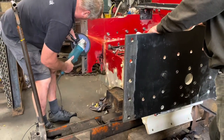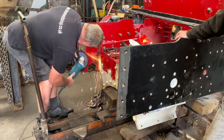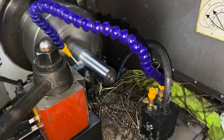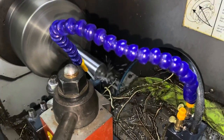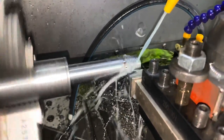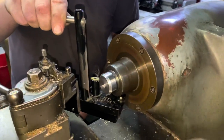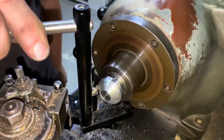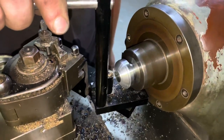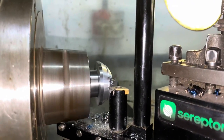Fastening the whole assembly onto the main frames, we didn't want to rivet these on — we want it to look like rivets but we want it to be removable. Practically, riveting through the actual frames would have been really quite difficult; we couldn't have got it up on its end in the press and it would have been quite difficult to support the dolly. So we're using the CNC lathe at Steam Workshop to machine specially rivet-headed bolts. It's exactly the same from the outside with the rivet head, but behind the scenes it's a bolt where we can put a washer and nut on the end, so if we ever need to take the buffer beam off we can. The actual rivet head itself is created manually using the spherical cutter tool in the lathe, which pivots around a point lined up with the centre of the rivet-headed bolt, allowing you to machine off the right amount to match the same diameter and curvature as the rivets in the buffer beam itself.